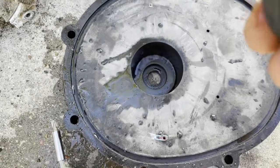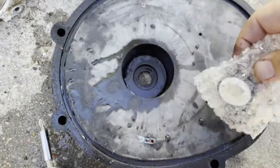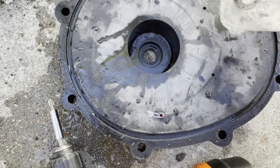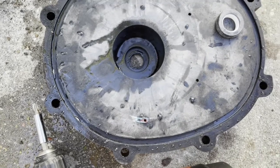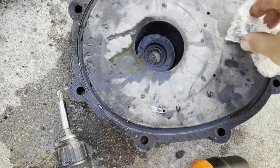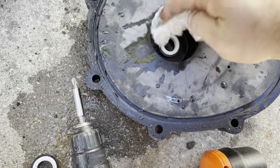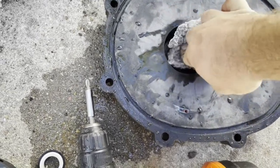Now to remove the old seal ring and put the new one in. One thing some people warned me about: you should not touch it with your bare hands because the grease from your hand degrades it over time. I'll use a nylon cover to handle it and put it back into its place. I already washed it and it's wet, so it should go in easily.